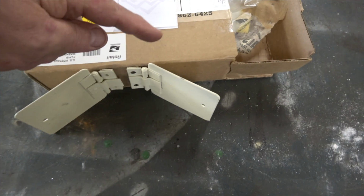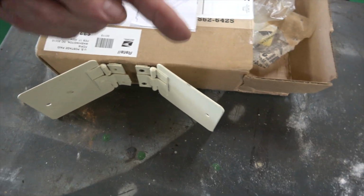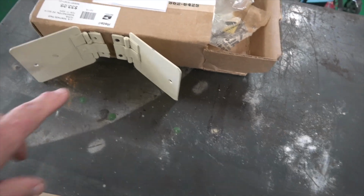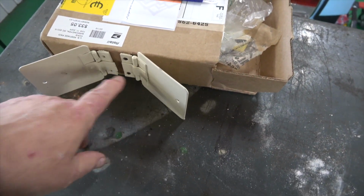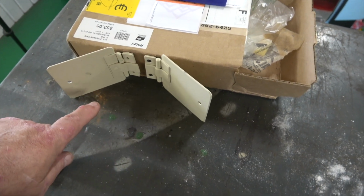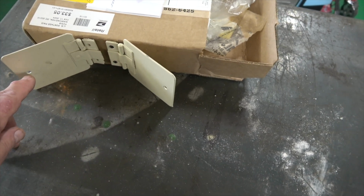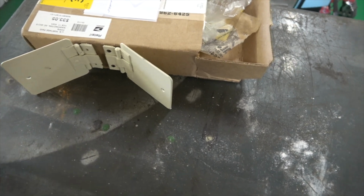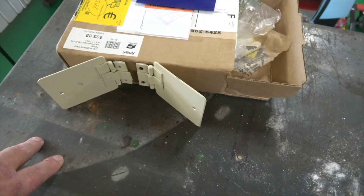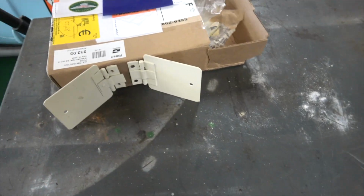You can imagine that this box is the bulkhead, and that's how they would open to allow air to come out through there and through there. There are a few anomalies with them. This one is spot welded, and this one has got a rivet through it, so I'm going to make them both the same. Obviously where the original handles went is in the wrong position, but it's going to be extended anyway. I will leave him to put the hole in it where he's going to fit it, because I think they don't fit in the middle like that, they fit to one side.